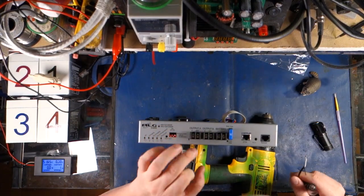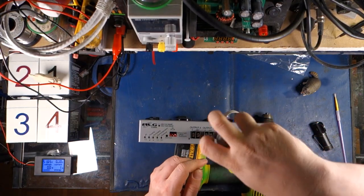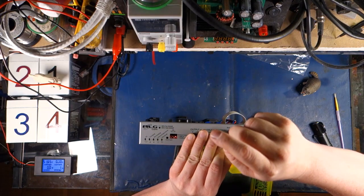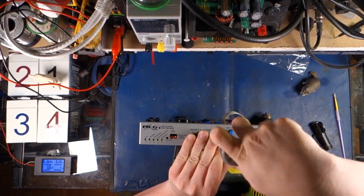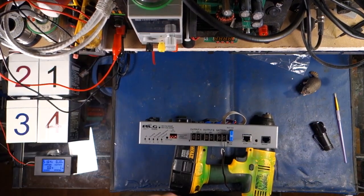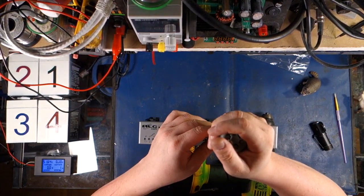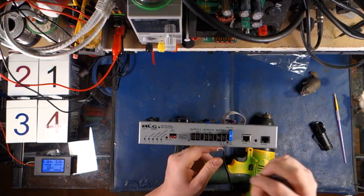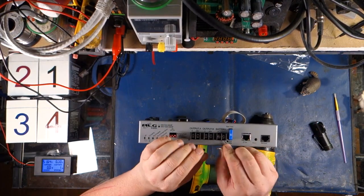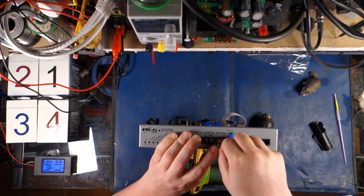Let's hook up the battery first. We're going to hook up the negative first. Off to my left, you will see that I have four 12-volt batteries in series. This is actually running in a 48-volt configuration — it goes 13.5, then 27, then 54 volts. That's typically the step up when you're going 12, 24, 48. So we're going to be running at about 54 volts on a float charge with these batteries.